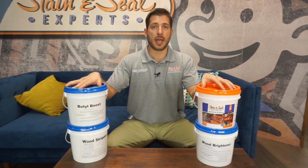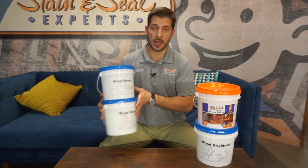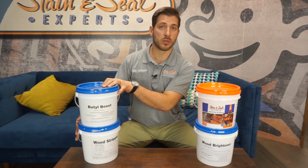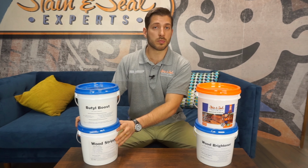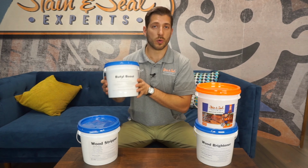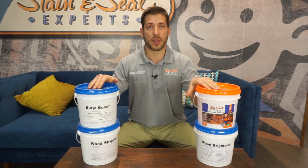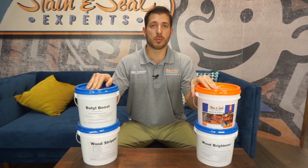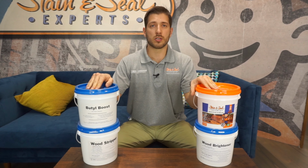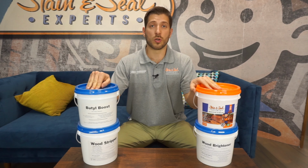So we applied a stripper, and what we used was the Stain Seal Experts wood stripper, and we boosted it with butyl boost. The reason we boosted it with butyl boost is because strippers work really good on oil-based coatings, but not water-based. This butyl is the magic liquid that we add in. The butyl is basically a water-based solvent. So when you put it into the mix of the stripper, it makes those water-based coatings just melt off like butter. We let that set for about 15 minutes, and the results that you saw, that's what we got after about a 15-minute dwell time.